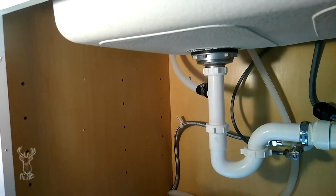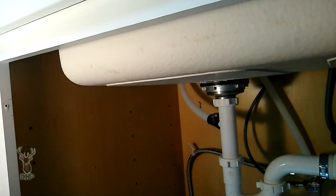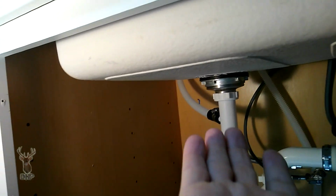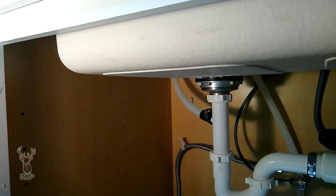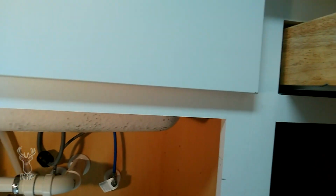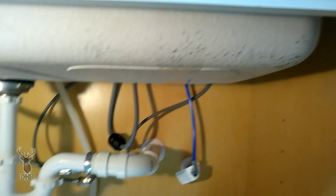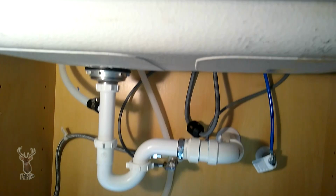Again, how do we put it in? We had enough room, a little gap between the ledger and the countertop, slid it in with the silicone, put it up into place, came over here, took our drawer out. Drawer was already out right here so that we could open our door, get our little hand in here to get to those 1/4 20 heads, put that ledger into place, and then we let it dry, came back and sealed around the top.